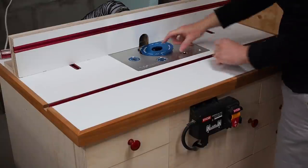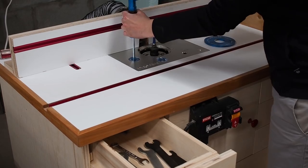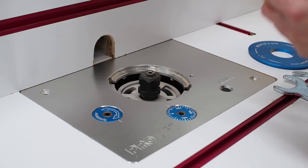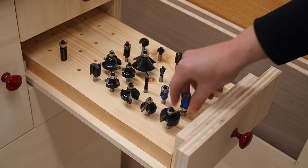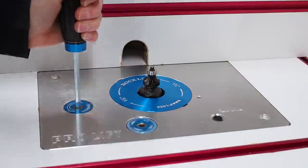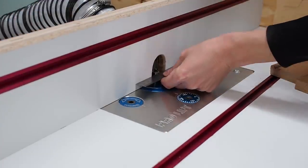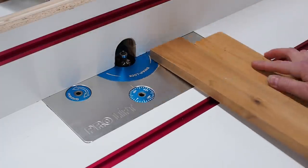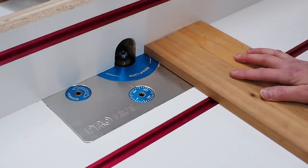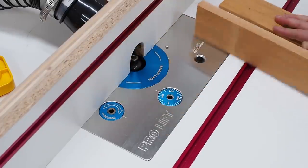It's been a while since I used my router table and this is the perfect project to put it to use. I want to soften all the board edges so I grabbed a round over bit and set it in the router. I adjusted the fence so that the bearing was just kissing the straight edge. It's best to start with the ends of the board since end grain is likely to tear out, and by doing it first you can clean it up later when running the board along the long edge. I'm also using a sacrificial trailer board which will reduce tear out significantly.